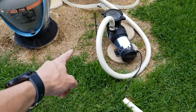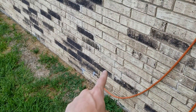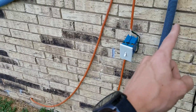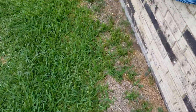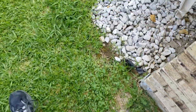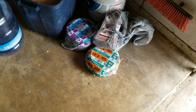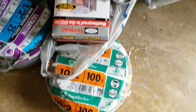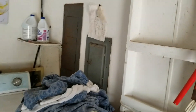I'm going to put in a real plug, a 4x4 post, going to bury a line, going to put a waterproof switch out here, and then I'm going to run actual conduit and line all into a breaker inside in the garage. Let me go show you real quick. Right around here — there's my 4x4 post. And there's all of the loveliness I need to work with today: waterproof boxes, electrical wire, conduit, and breaker boxes.